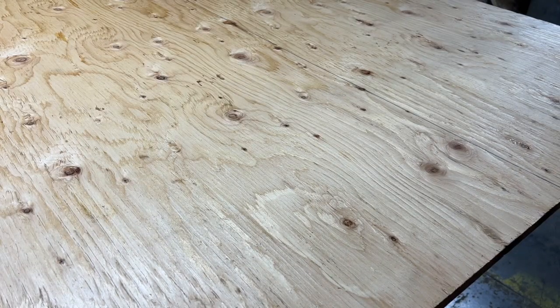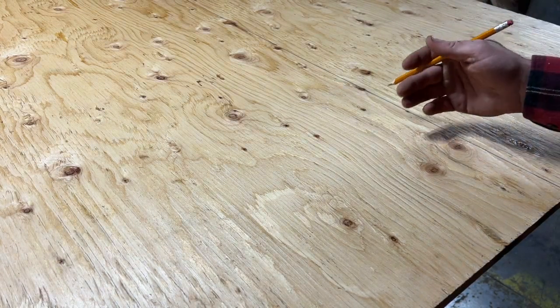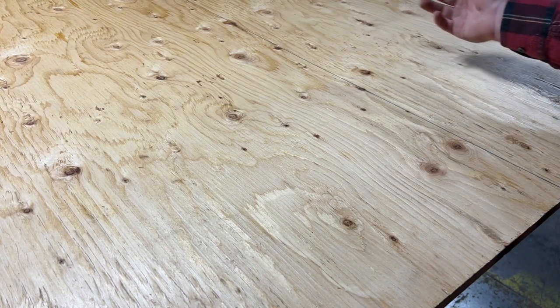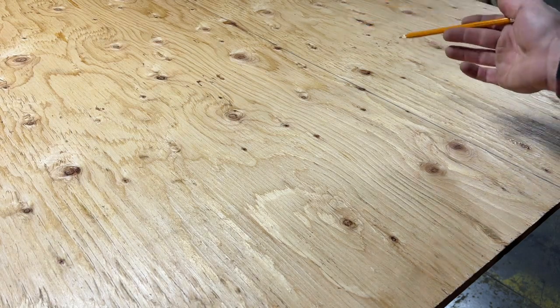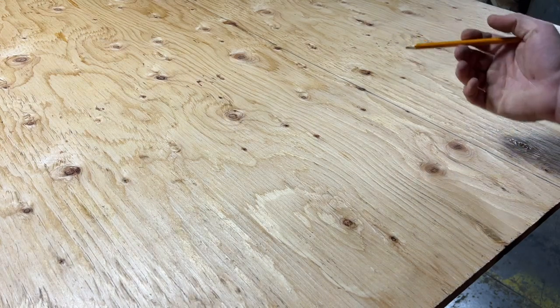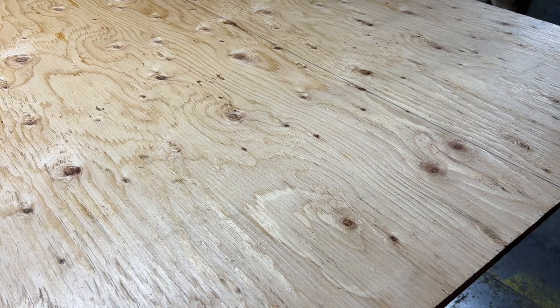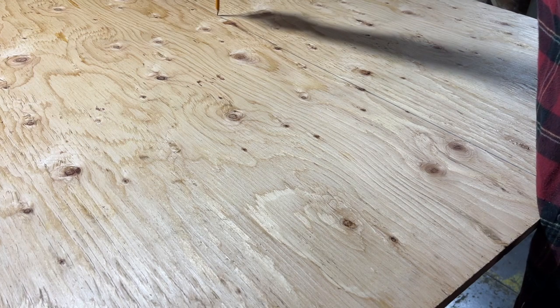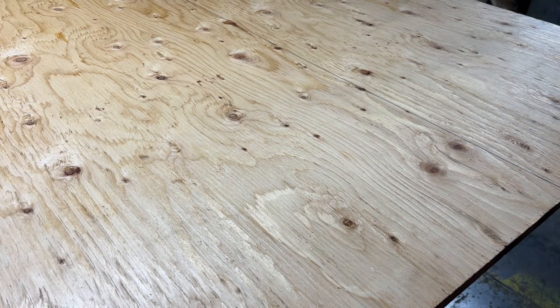With these squared off oval tables, it's really simple to cut out the ends that are circled, right? You know the width of the final table dimension is going to be, in this case, 48 inches. So you just find the center. There's very little math. You just measure out the radius, which would be 24 inches. Put the pin onto the center and then route out the circle. It'll eventually cut off itself because your table's the maximum width it's going to be already.